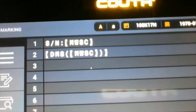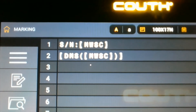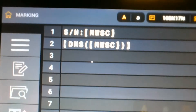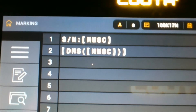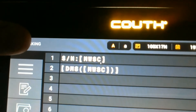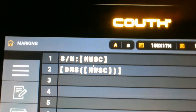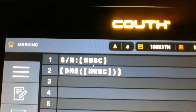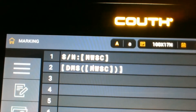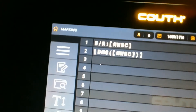On the smart box, I'll show you what the screen looks like. I currently have it set up to show a serial number and then fill in with a wait for communication, and then a 2D dot matrix with the same information below it. As you can see, we're in marking mode. That's important when using the wait for communication to fill it in, because if you don't set it up this way, you will actually take over the whole first line.